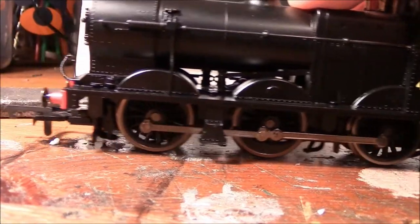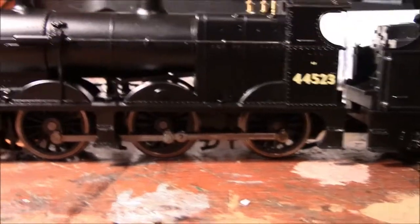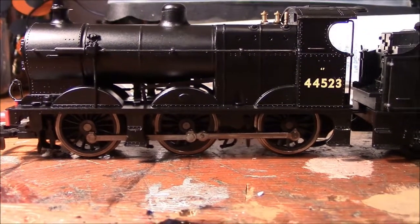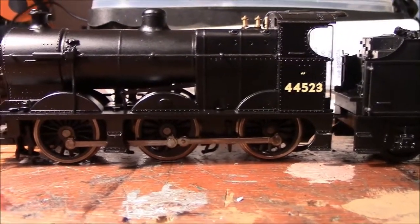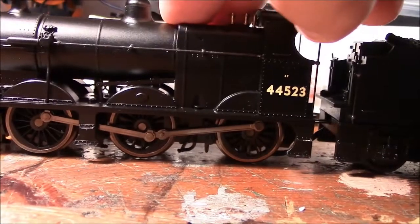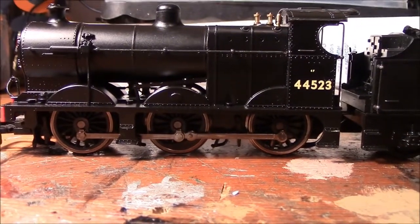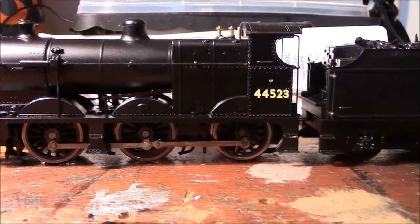Mine doesn't go round straight, as you can see, because there's no crank pins on the side, which means they go wonky. Well, what was happening was, guys, when I was putting the crank pins on the opposite side and doing the same thing, quartering the wheels up, lining up the crank pins and the rods nice and carefully, normally they should go up and down on either side of the loco, mechanically and visually should be nice and good. But for some reason they were sticking, and also they were doing this on each wheel, and that was on both sides. And I tried looking at that, taking the wheel off separately from the axle, lining it up properly and carefully, still the same problem. And the pins kept breaking, and I've just spent a lot too much money now on replacing these wheels.